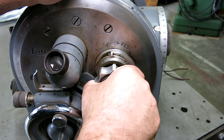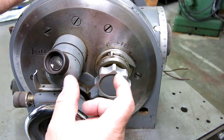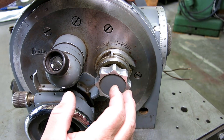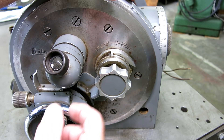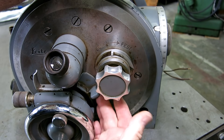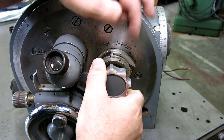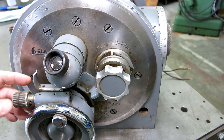This brake is really cool in that it grabs the brake disc from two sides, so the force is symmetric. There are no deflections that push the spindle out of alignment. To release, you release the little thumb lever and back off — and it's got a stop in the other direction too. This knob is satin chrome plated; it's got that real satisfying clicky feel — super nice instrument quality.